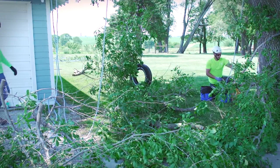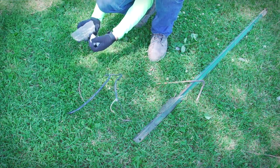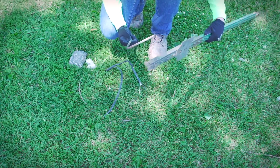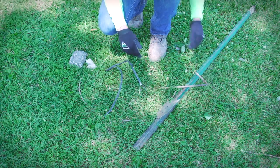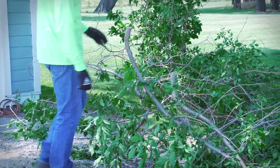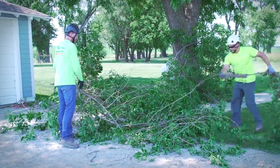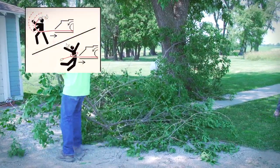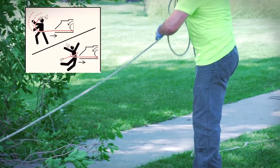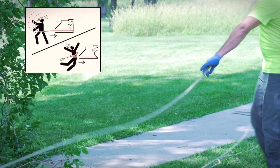Examine your brush before feeding it into the chipper. Make sure no contaminants are fed, such as stones, wire, nails, or other metal objects which may damage chipper knives or become dangerous projectiles. Also, make sure lines, vines, and ropes are not in the brush being fed. These materials and anything attached to them will be pulled in at high speed. Death or serious injury is possible if you are struck, entangled, or pulled into the machine.